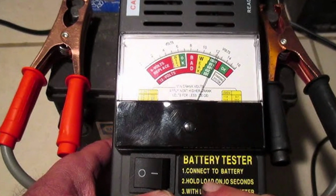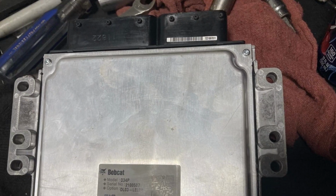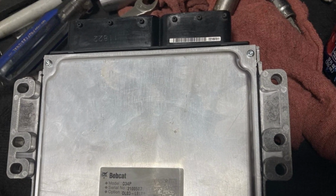If this doesn't help, I would try plugging in the scanner and checking if it can communicate with the ECU. It's very likely that the engine doesn't start when you see this code, but the scanner should connect to the ECU and read the codes stored there. If it can connect, the problem is probably not with the wiring or the ECU itself. If it can't connect, you should locate the ECU, unplug it, and check the condition of the connector. It may be corroded after any water intrusion, and it may be the reason for connection loss.